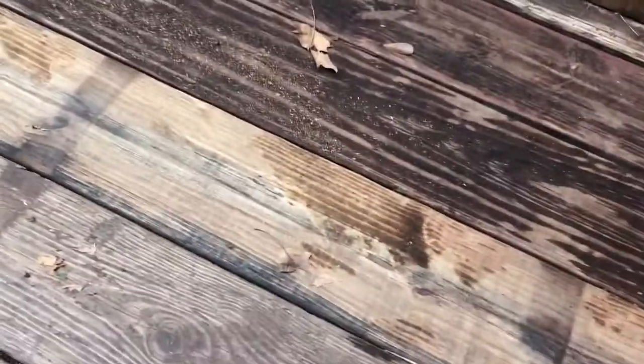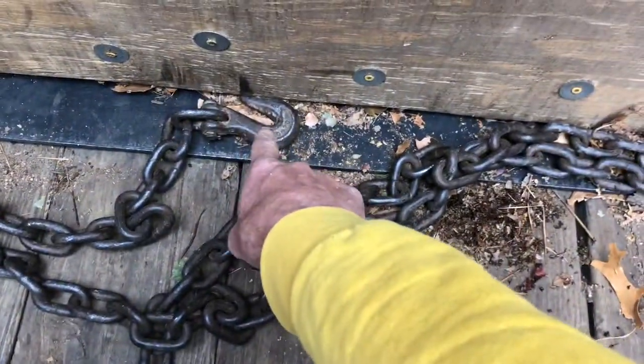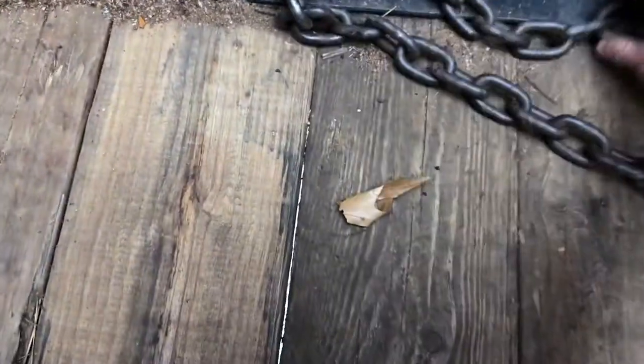Those all pull evenly and then this is buried down the middle of the trailer — buried by a bunch of debris. It's very important that this chain is at the bottom of your pile. If you come in after the fact with a chain higher up, whatever the chain is on top of will not pull out. The pallet will not pull that out. So we start by making sure that this hook is dead center right against the gate so that when this gate drops — this is just a wall of leaves — we just need to scratch right here and we know that's where the hook's gonna be.